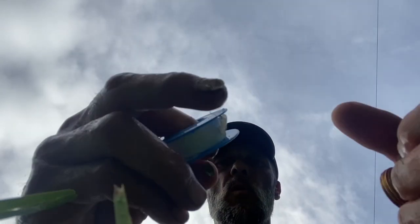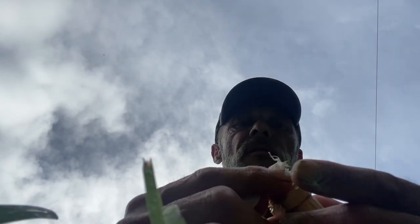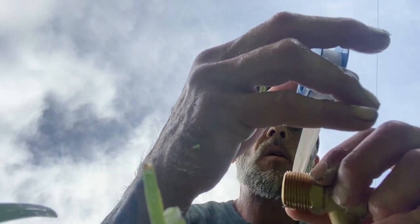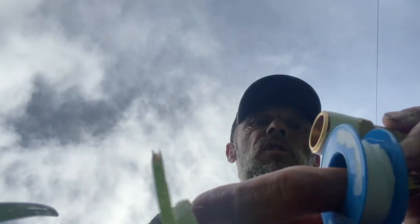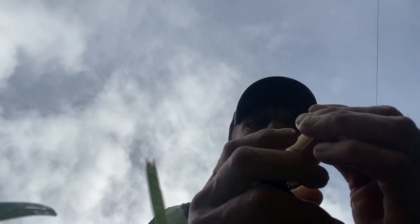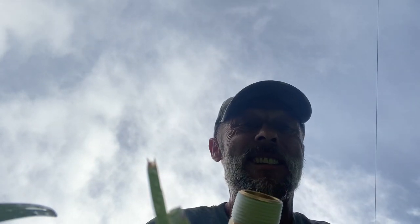We're working with three-quarter inch here. We put a ball valve in there — an IPS ball valve, three-quarter inch — for a couple reasons: it was easier to shut the thing down while we're working. We were successful at backing that thing out. I would not suggest anybody try to do something like this — call yourself a licensed plumber or a well specialist, because the chances of breaking those threads are better than actually taking it off like I did, which was just our lucky day. A little bit of pipe dope and we installed it.